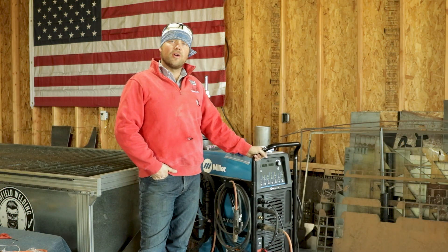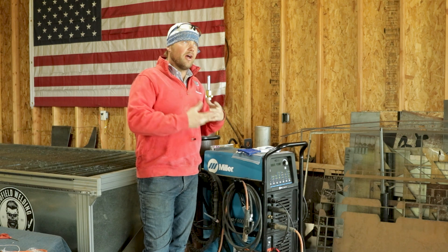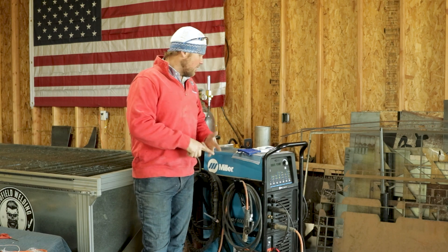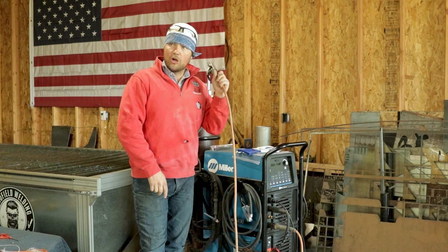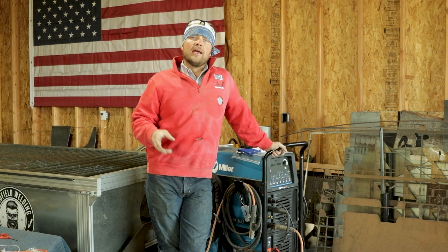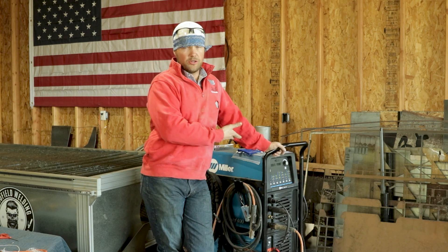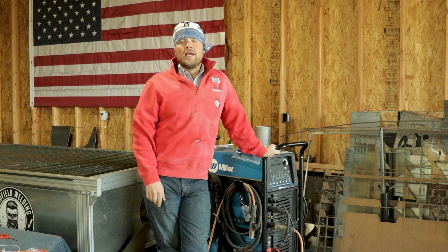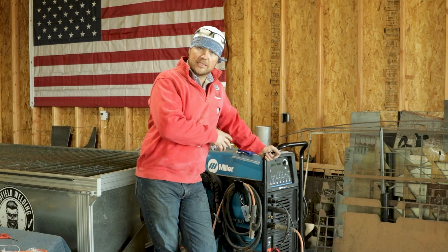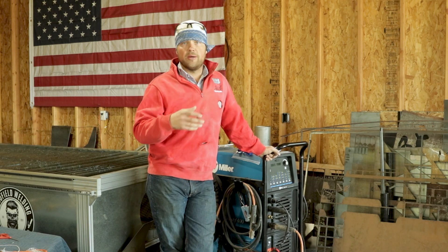Today's episode we are talking about the new Dynasty 400, the Miller Dynasty 400. This machine has been awesome. I've been on the road for quite a while, so I don't have as much experience with the machine as I'd like, but we have welded a little bit of aluminum with it and we're getting ready to weld some stick. I have a test coming up tomorrow — I have to go get a set of procedures built, test for the procedures, and then the procedures are for my company. We're going to use the Dynasty 400 to run some practice coupons, some 2-inch Schedule 80. Pretty simple stuff, but we'll throw it up in a 6G and show you how to set this up for stick. Later on we'll show you how to set it up for stainless, aluminum, and all sorts of different things.